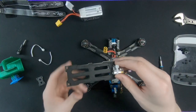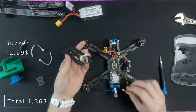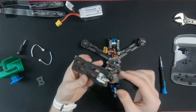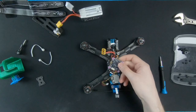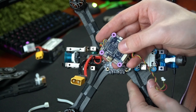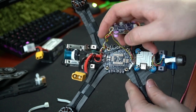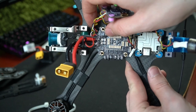I also have a beeper attached to the frame. It has its own little battery, and if I lose my drone while flying, it will make a loud noise even if the main battery is disconnected. If you look closely, you can see that all of my electronics are covered in conformal coating. It looks similar to nail polish and creates a non-conductive layer on top of the electronics, so I don't need to worry about water or snow getting on my drone while flying and causing a short that burns a component.